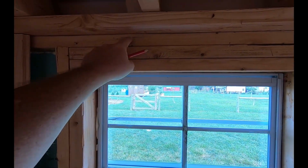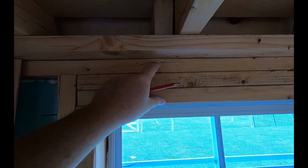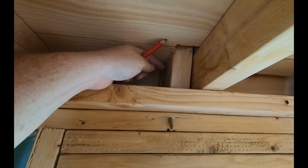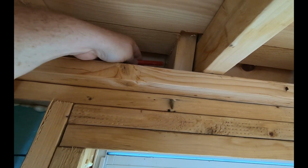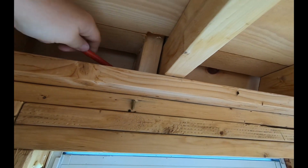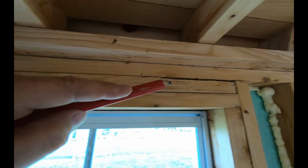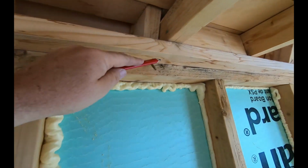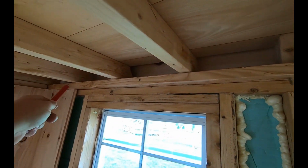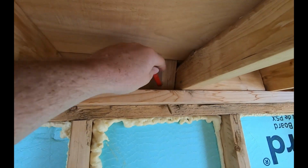Along the way, I'm gonna have to cut these construction screws off. If you remember, you can go back and watch the video where I put the trusses in. Those screws are coming down from the truss. It's lagging through on an angle from up here, going through the truss, going through the top plate, and they just happen to be a little long and it came out the side. So I got those three I have to cut off. Those are what's holding my trusses in. You know, holding them on top instead of using like a hurricane tie. And they're also toenailed up in here.